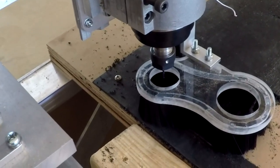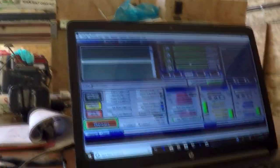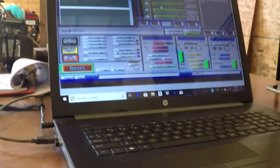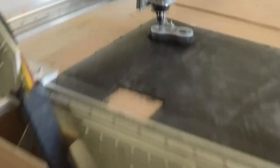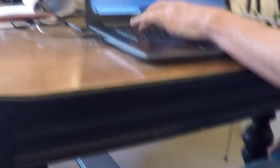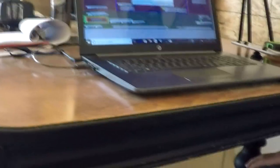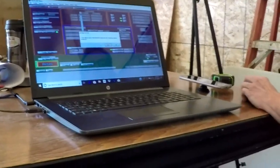You can see it's now doing the X axis — those two same movements — going really slowly towards the back of the machine to ensure good registration for the origin. Now X and Y are at zero. Z is correct — I'm not going to change Z. Let's do another calibration and go a little farther — six feet, or 72 inches. We are at 72 and 3/16ths — 72.1875. It changed from 1434 to 1430 steps per unit — about four steps per inch difference. And we're done.